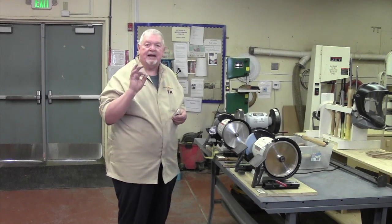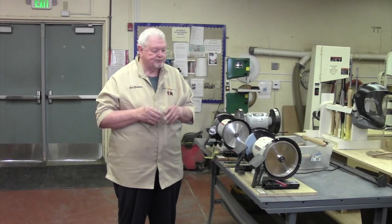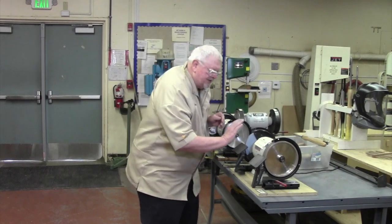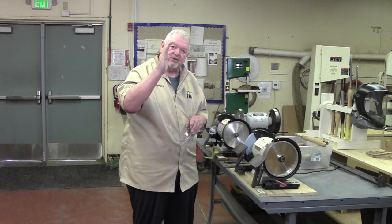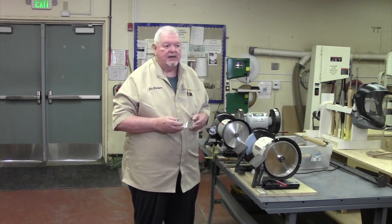You've seen all this because we have them in all the videos where we talked about how to sharpen the roughing gouge, the skew, and so on. This is one type — a kind of grinder that creates a hollow grind bevel on our tool. I'm going to show you another system that also creates a hollow grind but a much flatter one, then a third system that actually gives you a flat bevel. All three are widely used in our particular area among our students.